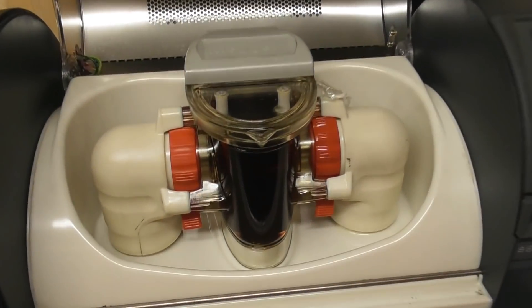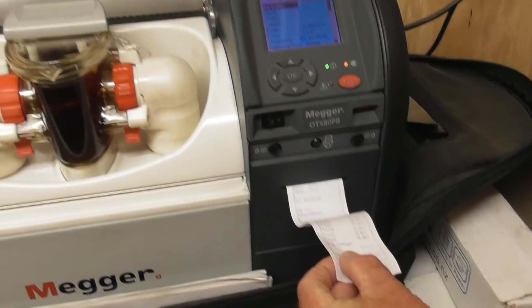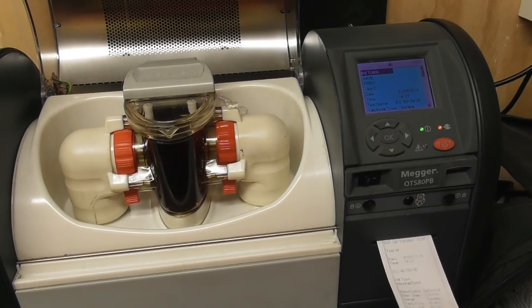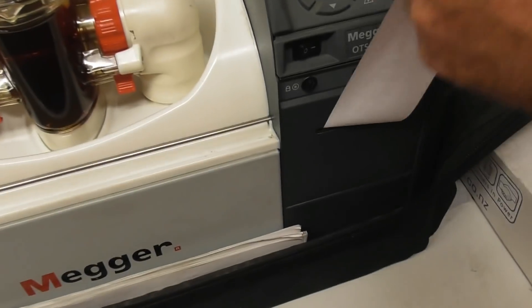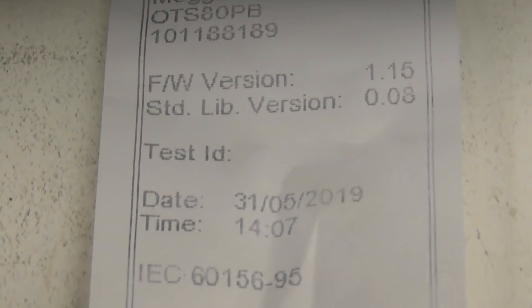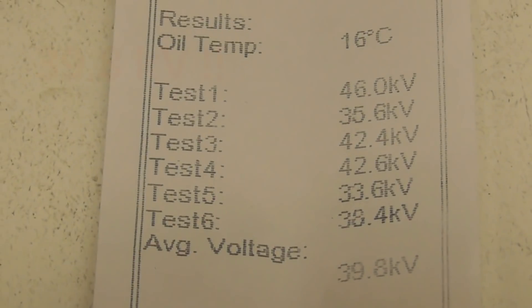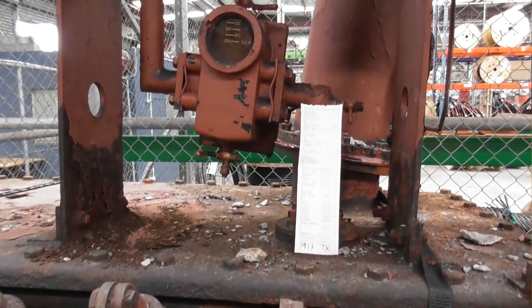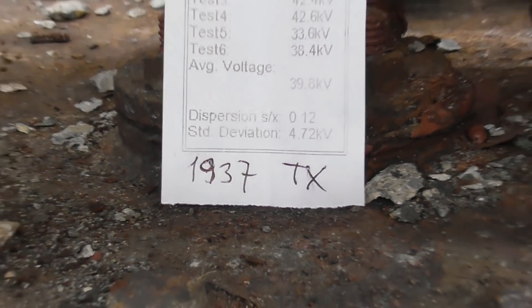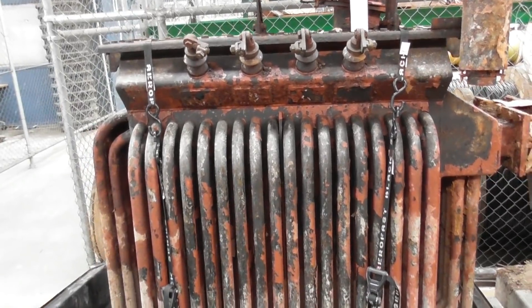Average 35 to 39 kV. 39 kV - that's bloody brilliant! Exceeding my expectations for an 82-year-old transformer. So the oil is most likely 82 years old. Here we've got the test results - the oil reading is 39.0 kV for 82-year-old transformer oil. A 1937 transformer, the oil would have been 82 years old, sitting for more or less 30 plus years de-energized. And it passed with 39 kV. Quite amazing.